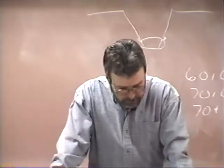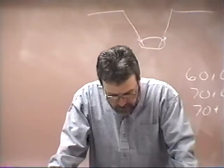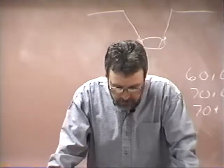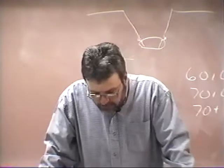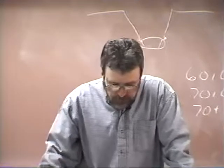Flipping the page, page 114, stop and restart. When it is necessary to stop the weld before the bead is completed, the arc is broken by a quick flicking of the end of the electrode downward away from the keyhole, as shown in figure 8-19. This will prevent slag from mixing with unsolidified weld metal to form a slag inclusion.